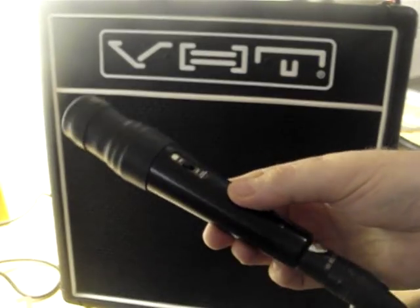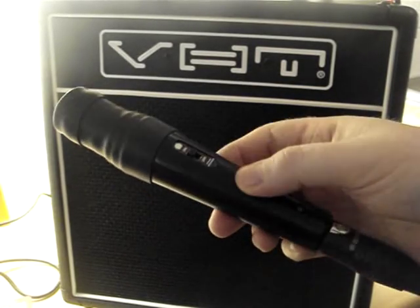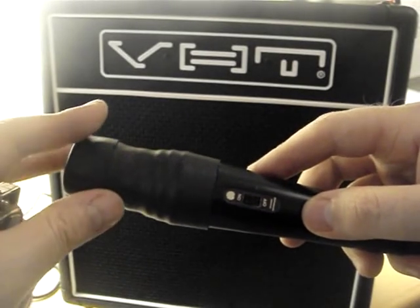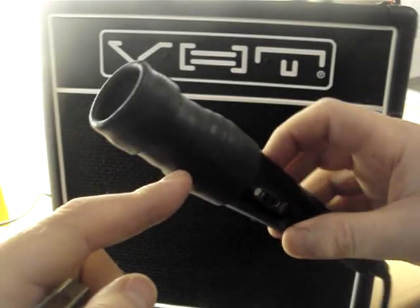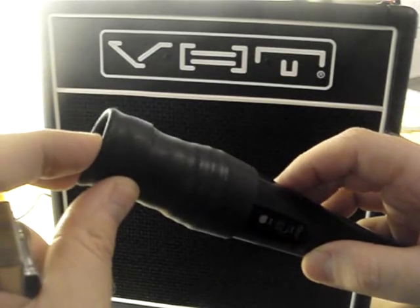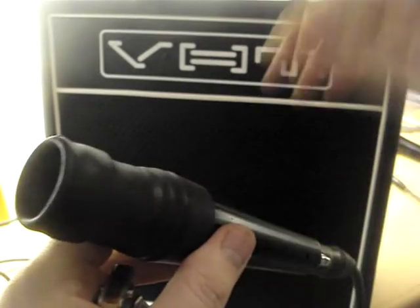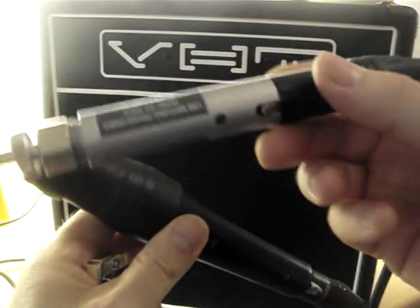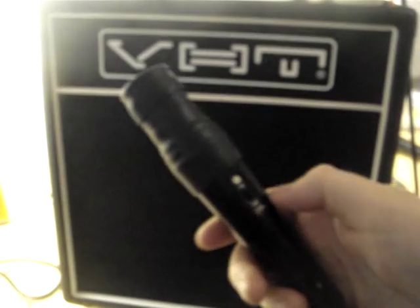Here is another example, a cheap vocal mic. I've always had it, and it never sounded good. It had a ball here, like every vocal mic. I took it away, played directly to the element, and it sounded perfect for me. And then I had some rubber here, bicycle tube, to make it more airtight, and some protection here. So as always with vocal microphones, through an amplifier you need an impedance matcher here and an XLR cable. So I really love this sound, and it's cheap.